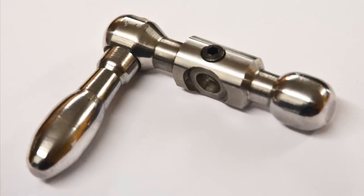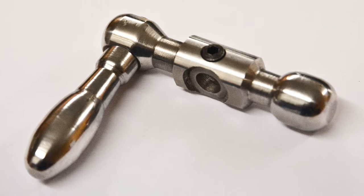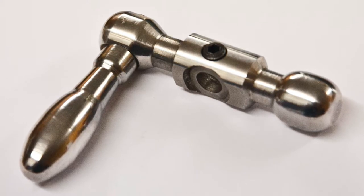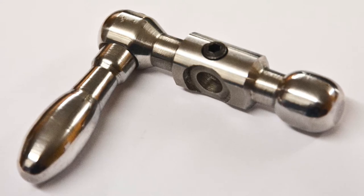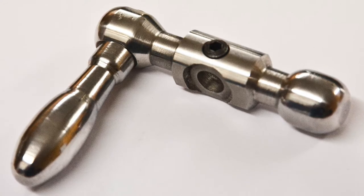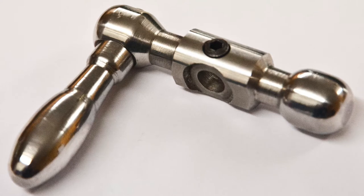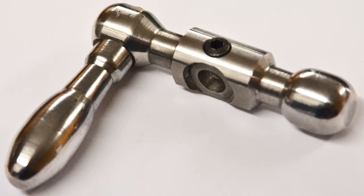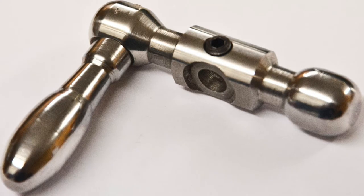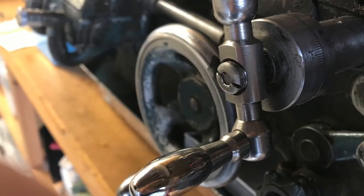With the work secured, I could move the milling tool along to cut the slots I needed, and the final photo shows the end result. To complete the repair I also had to make a new handle for the cross feed. The reason for all these repairs: I had a big problem moving the lathe, which weighs 380 pounds. I put straps around it forgetting the underside of the lathe bed was sharp, and although I had six different ropes knotted separately, it cut through all of them at once. The whole thing fell on the ground and bent the cross feed, damaged the gear selector, and damaged the handles for the 40-speed gearbox — but I've been able to repair all of those things, and this is the repaired cross feed handle.